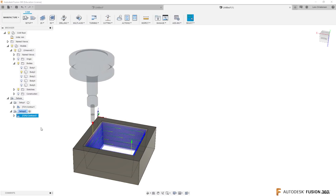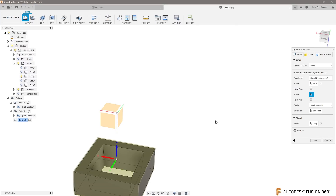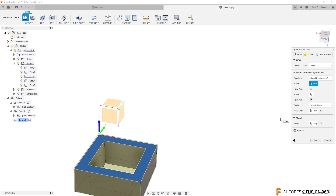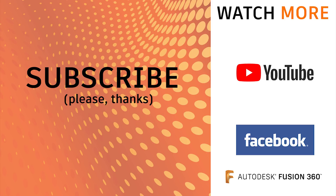And then I could go in and do the exact same thing again. I could actually program them all kind of like in layers like this. So now I could turn body number three on, create a new setup, and do the exact same thing you just saw me doing — clicking on that point. Then I would post each code out separately in that manner. I hope that answers it. That would be one way to do it. I'd almost call this the lazy way to do it, because now we are just programming everything as it was stacked up instead of using the move tool and laying it out, which would probably be easier to visualize. But I think that's a neat way to do it. If you ever go back and change anything in the model, since they're programmed stacked up, it might be a little bit easier to manage.